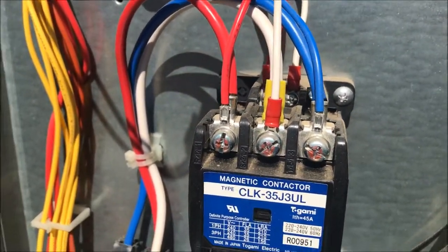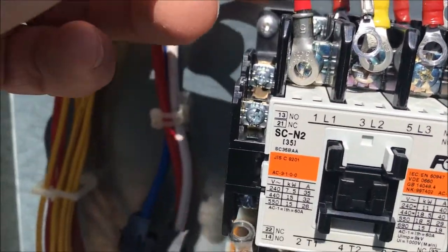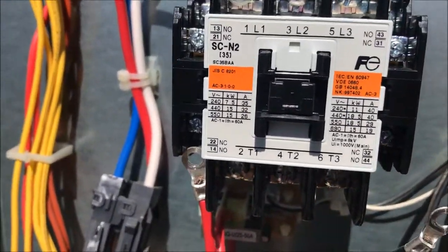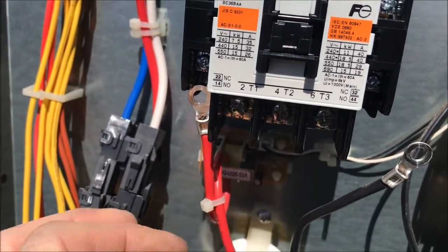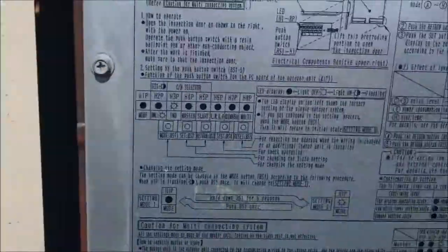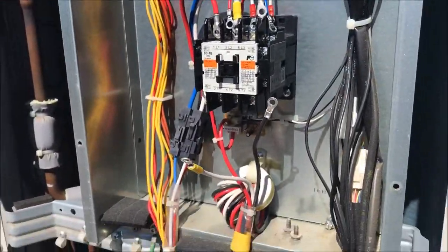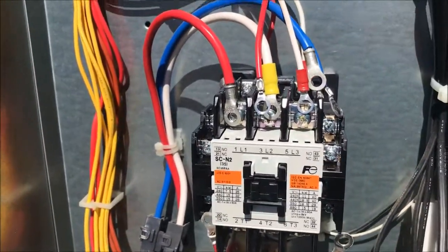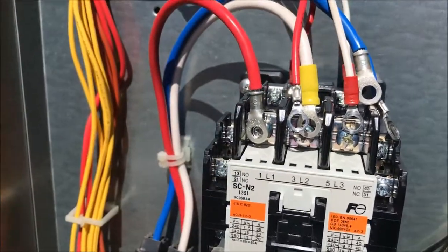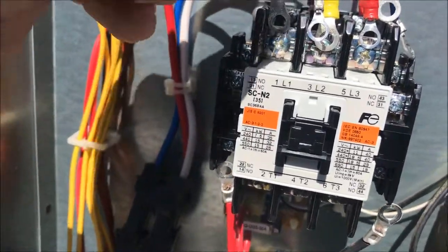Get all this back up. I'd mentioned in one of my videos — you need to make a note on the inverter video — your red, white, blue, and black going to your compressor. Keep the wiring order in your mind: red to red, white to white, dark color to dark color. Somebody asked me why I didn't refer to the schematic. There is no schematic up here at the unit — it's all in the service manual, and half the time when you've got a repair in mind you don't have the service manual at hand. So it's easier just to remember the color and order of your wires.